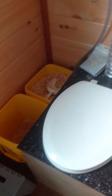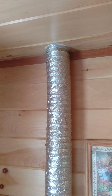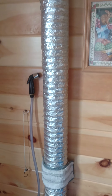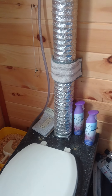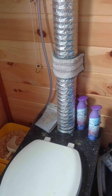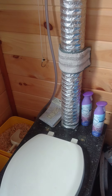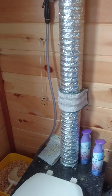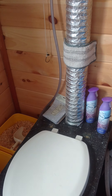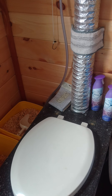Another way that I manage that smell — you'll notice this looks like a dryer vent, and that's exactly what it is. It runs up through the ceiling and continues above this bathroom area, and another short section of this very same dryer vent goes out through the wall of my cabin. Inside that vent right at the wall, I have adapted a three-inch computer fan. They take very little energy, and that fan will run continuously. Because it's running continuously, it puts this entire container and all of that dryer vent under negative air pressure — negative air pressure is just a real soft, gentle vacuum. That vacuum means that even while you're using this toilet, you don't have any odors associated with it.